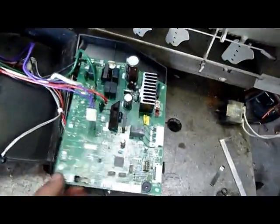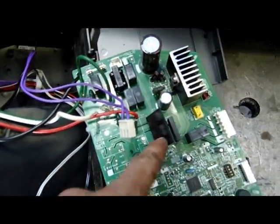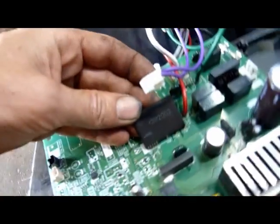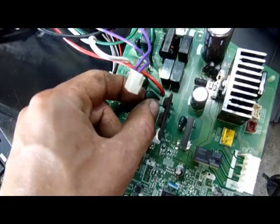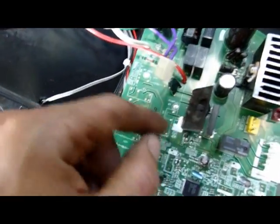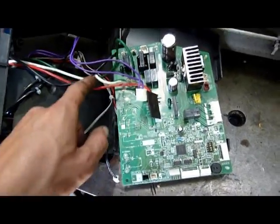Okay, back to the Fujitsu. Now let's look at the control side of things. There isn't much in here because most of it's in the outdoor unit. The red one is the communications wire — it comes out through this little sealed multi-pack thing. It's got several fine wires as well as what look like DC wires, and AC neutral goes in there. It still uses serial communication though. There's only three wires: two power wires and the red one, so that's got to send all the commands.